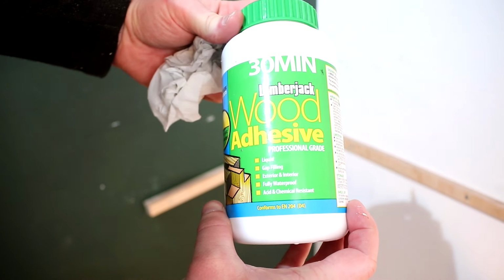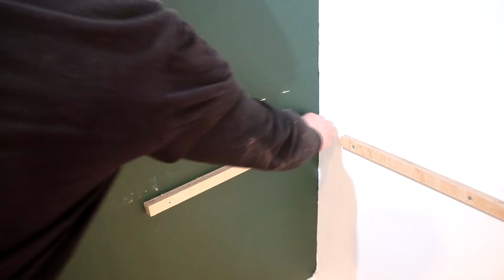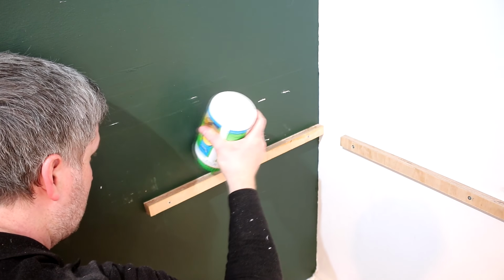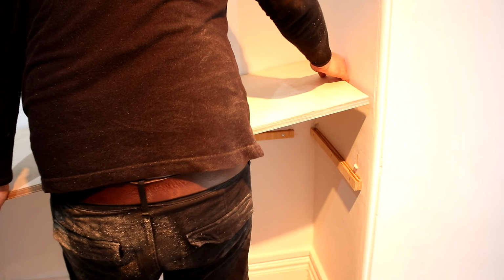I'm going to be using polyurethane glue to stick the shelf down onto the battens. This stuff's really good and I'll link to it in the description box below. And before I add the glue, I first needed to add a bit of moisture to one of the surfaces, so I used a damp cloth. I could then add the glue and fit the shelf, and it was a really nice fit.